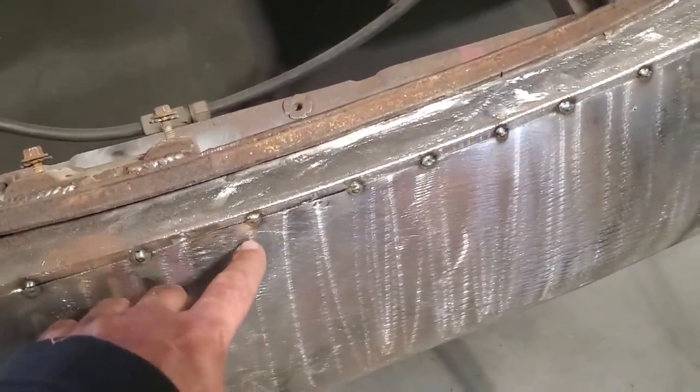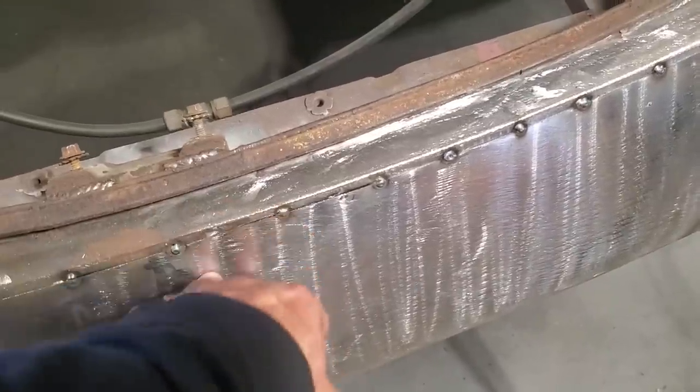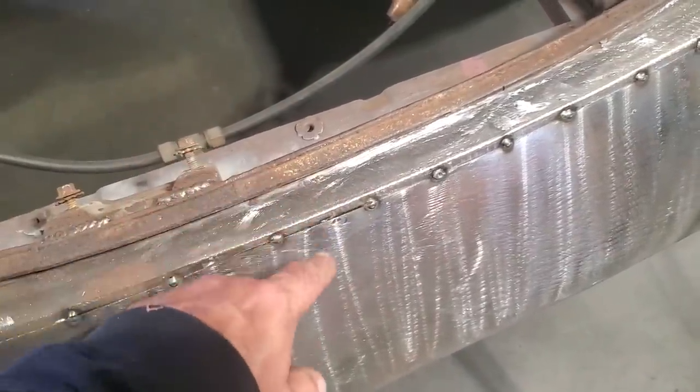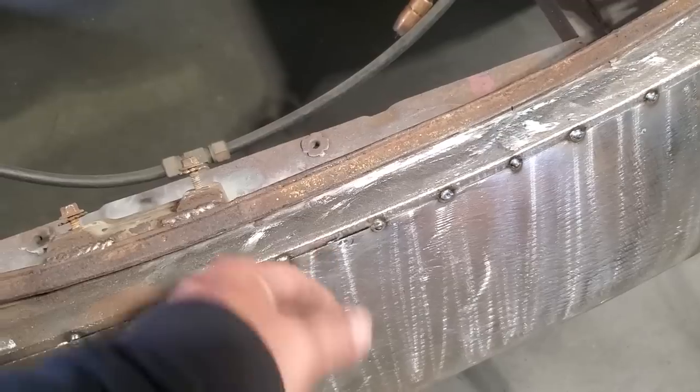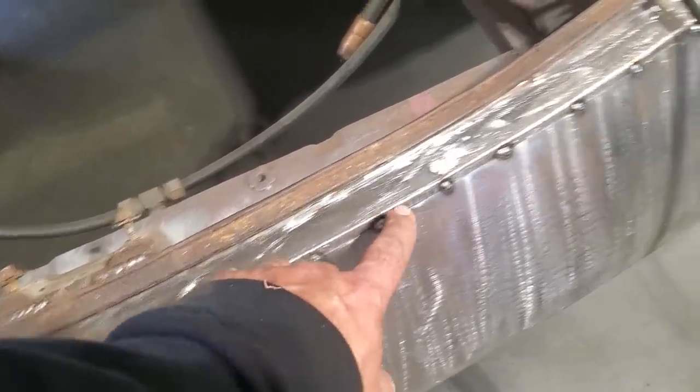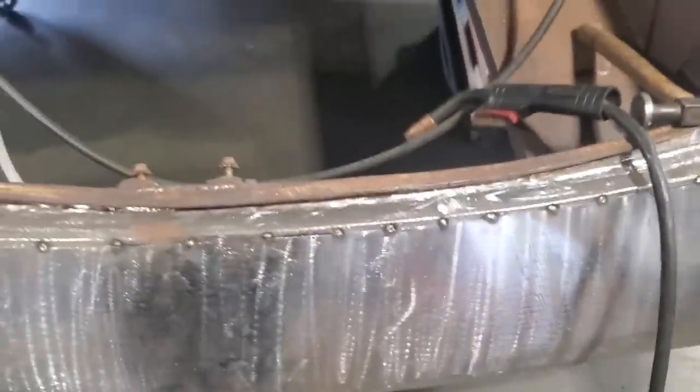Basically, all I'm doing is cutting it, and where I welded it, I'm welding it again. Okay? And I'm only going to tack weld it in place because I have to remove the piece from behind first, or get it broken clear anyway, so that I know it's let go before I can continue on. So I'll go ahead and get all this cut and butted in place.